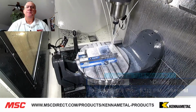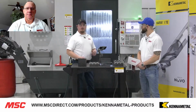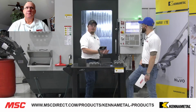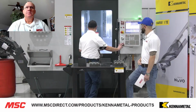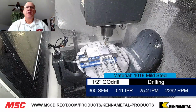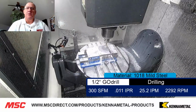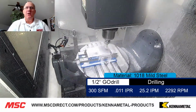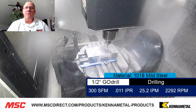Now, one thing I noticed, Tony, when we were running these in that testing phase, was the quality of the hole, and not only the quality, but the tolerance of the hole. When you get into a high-speed tool, you kind of lose that quality and that ability to hold a tolerance with that kind of tool. Oh, absolutely. We think of a drill making a round hole, but when you really get down and use the equipment to measure the diameter and the roundness of the hole, they're not always round. That would depend on the specifications of the part that you're machining.